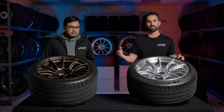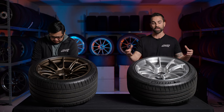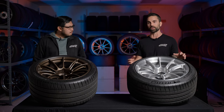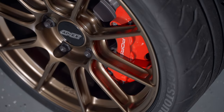All three designs are made from our custom dies. These blanks start off at about 120 pounds — a lot of material — and this is critical so that our engineers aren't handcuffed in what they can produce from a fitment standpoint. Going to super wide widths for a GT3RS or a Viper, they need all the grip, and it affects things like brake clearance and spoke design.